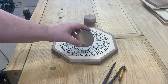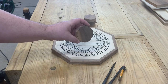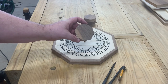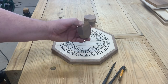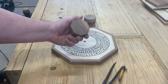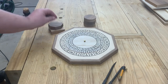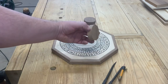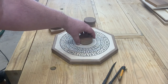I just take this down to round using the sanding disc on my sander. I've CNC'd these things, cut them out with jigsaws, done all sorts of things, and I've found that the little disc sander is probably one of the underrated tools in the shop, even with a 120 disc on. You'll take these edges off real fast — these don't need machine precision once they're sanded. I'm left with about a two-and-a-half-inch round disc, which is just about fine.